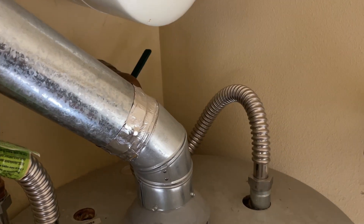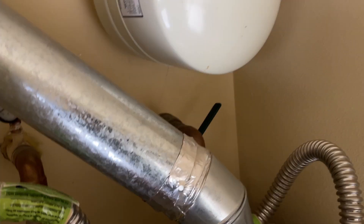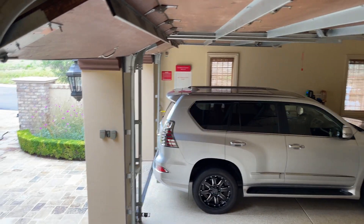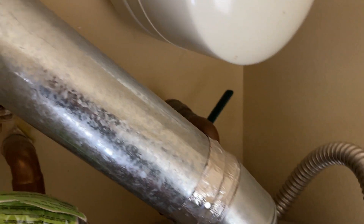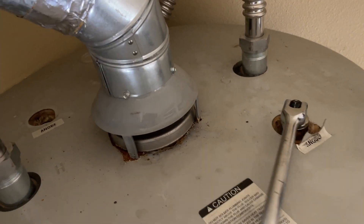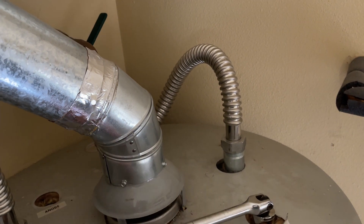Place it like this. Make sure you have the water turned off first to the house. I also turned off that valve there to the house and the one at the water heater. I did open some faucets inside to release the pressure. So once you put the tool right here, it goes like this — here we go.